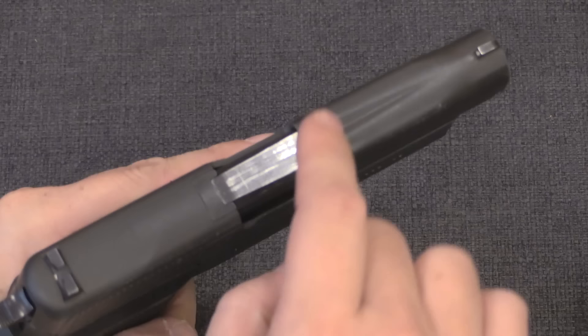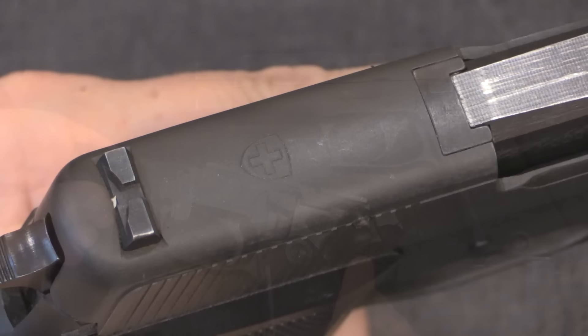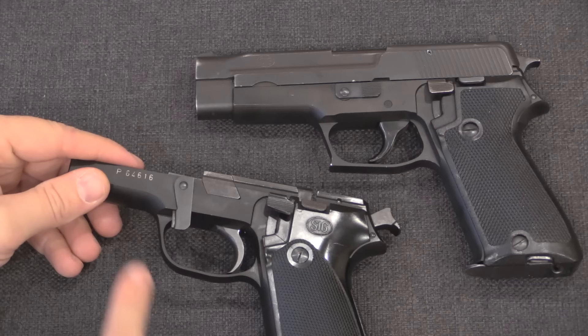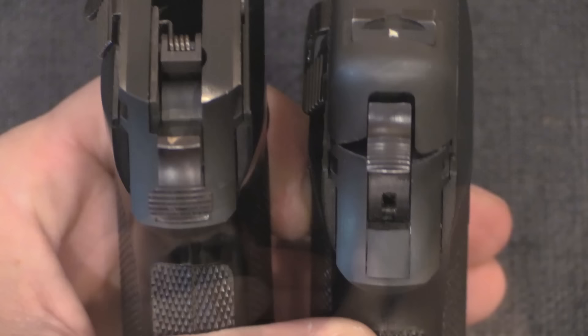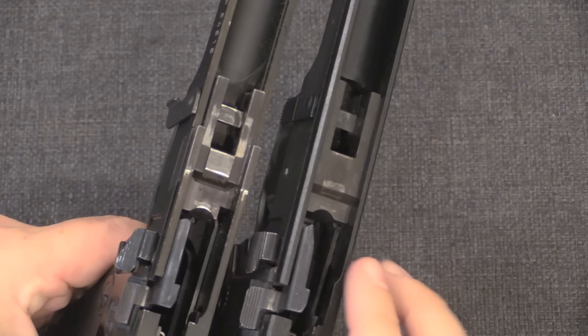This shares pretty much all the distinctive elements of the prototype. There are only a couple of major changes that were made. You'll notice there are still the stamping contours up on the top of the slide, and these have this cool Swiss shield on them — being military pistols made by SIG. One change is the addition of a little finger rest ledge to the front of the trigger guard; the prototypes had all been round trigger guards. The other change is the hammer — the prototypes had all used a wide beavertail hammer, while the production guns have just a narrower serrated hammer.